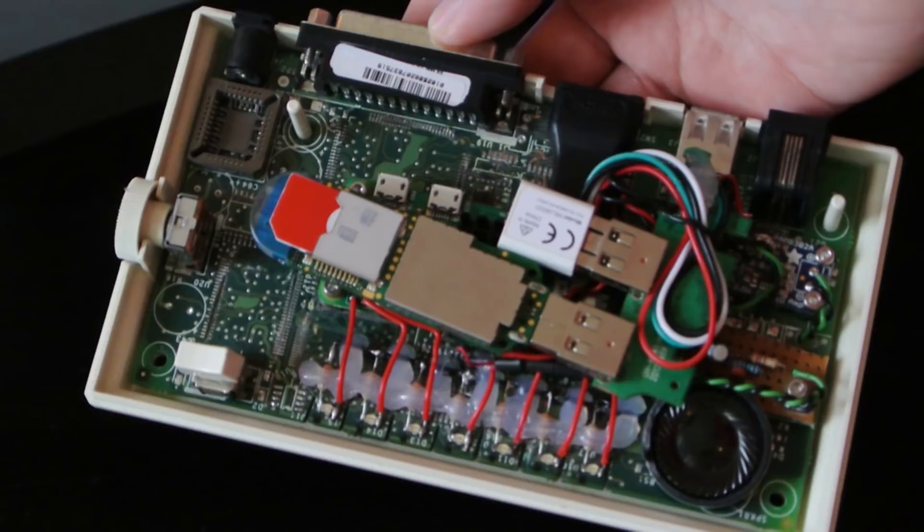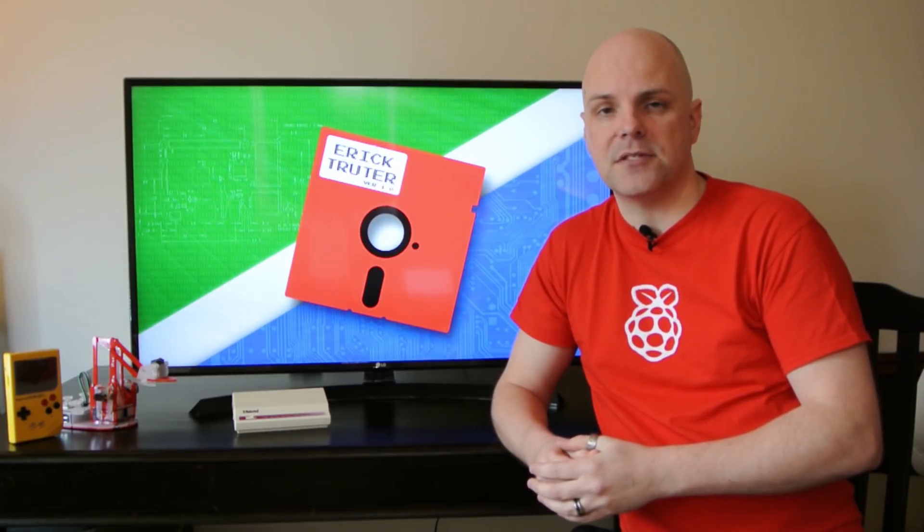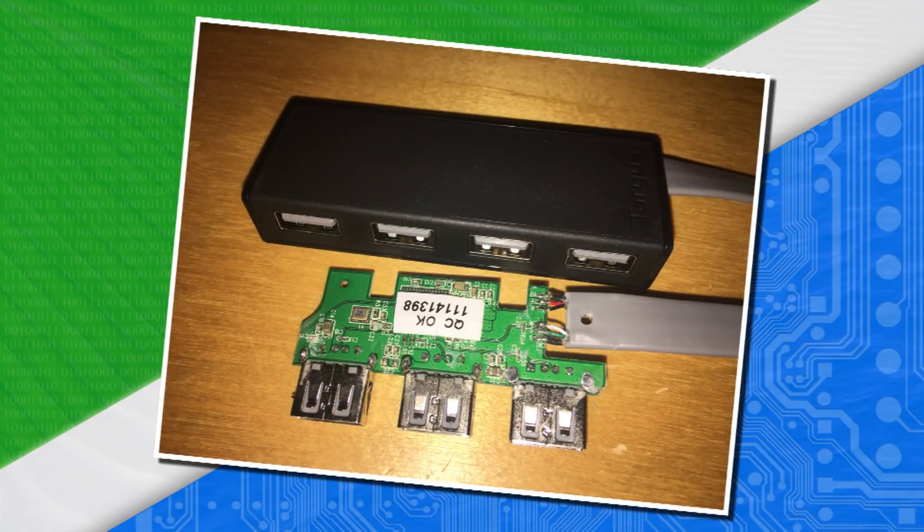For the components, I used the Raspberry Pi Zero and a USB 3G dongle. I did not use the Raspberry Pi Zero W because I was finding the Wi-Fi signal was struggling to create a sustainable Wi-Fi hotspot. Therefore, I went for the traditional Zero and used a USB Wi-Fi dongle instead. In terms of prep, I cleaned up the original circuit board, removed all the capacitors, resistors, and chips to free up space. I also stripped a USB hub, which I resized to fit inside the case, since the Pi Zero only has one USB port and I needed at least two devices.